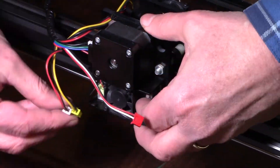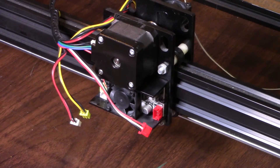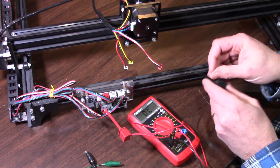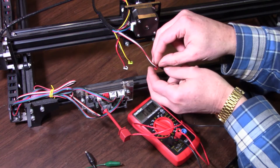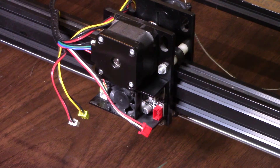There's just these two screws that hold that on so we'll get those back on. The next thing I'd like to test are the wires — that black, white, and red wire. I've got my multimeter out and some fancy little probes here. I'm going to connect onto the red wire, then the white, and then the black, to make sure that the electricity is flowing through there and the continuity is good on the wire. All three tested well.